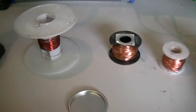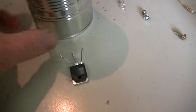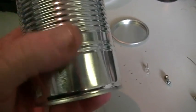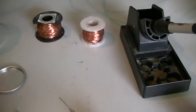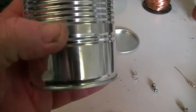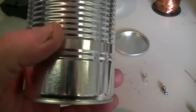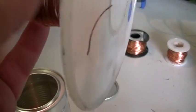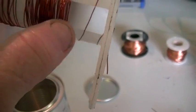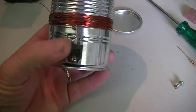You're also going to need some wire. I'm going to drill a hole in the bottom here so we can screw our transistor to the tin, so the whole tin is going to become the collector of our transistor. A little bit of sandpaper to clean the tin up where we need to solder wires. First thing I'm going to do is mount the transistor and solder the collector to the tin as well, just to make sure we get a good connection. I'll then go ahead and wind the first of our two coils — I'm using 0.55 mm wire.